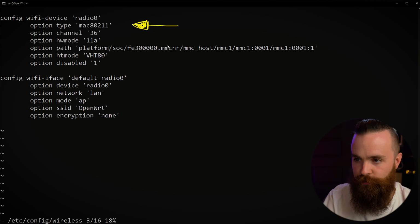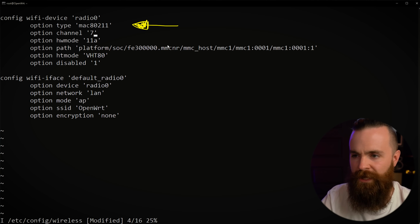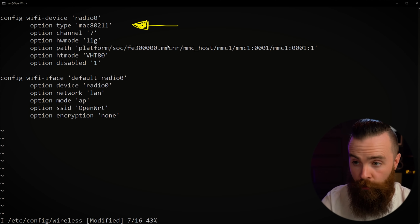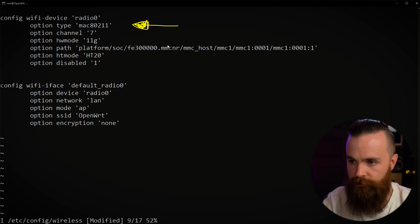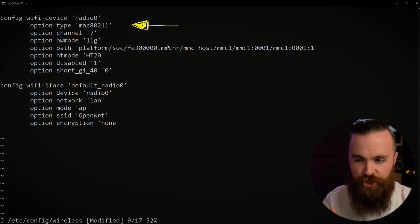Let's make some changes. So first we're going to change our channel. Right now it's 36. Hit i when we get there. Change it from 36 to something like 7, or yeah, just do 7 for now. You can change it later. We'll change our option hwmode right here from 11a to 11g. Then down here, option htmode, we'll change it from VHT80 to HT20. And then we'll add one more line underneath option disabled. Just do it, enter, space on over, option. We'll type in short_gi_40, and then space, single quote, 0, single quote. That should be all we need.